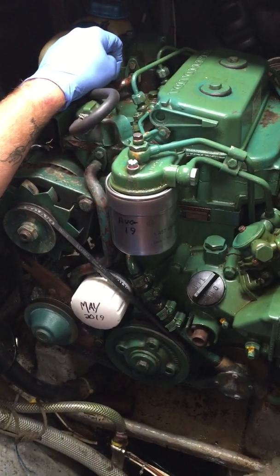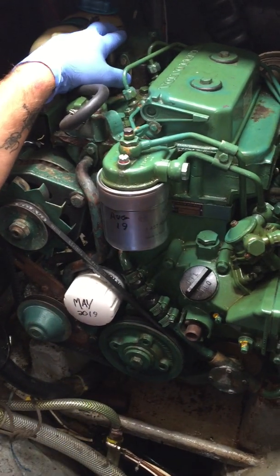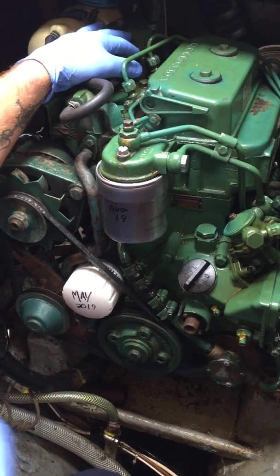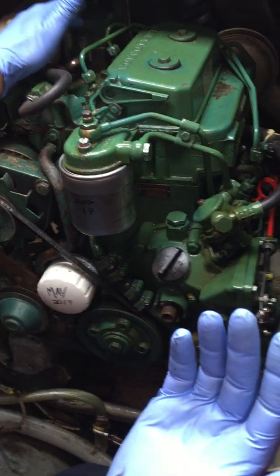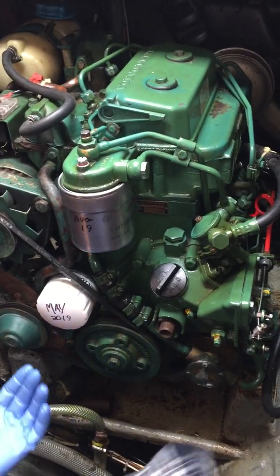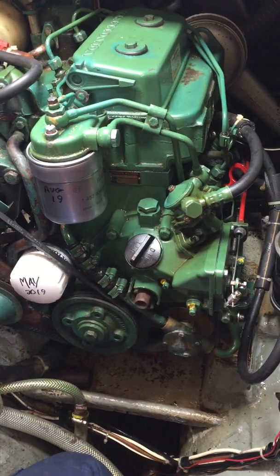The nice water - that is all that's going through the engine. All that's really touching the engine is the exhaust, and that's the salt water side dumping on its way out. So it keeps the engine clean - it's not got salt water sitting in it for lengthy periods, which is what evidently kills them. That's probably saved this engine. But it's a very expensive upgrade.